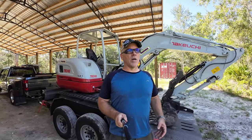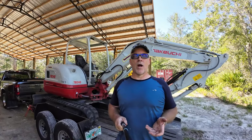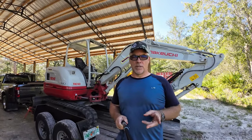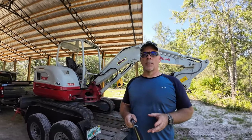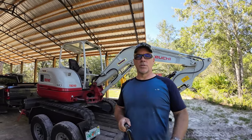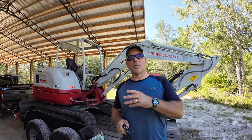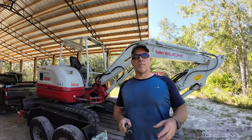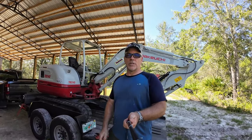But if you've watched any of my other videos in the past, the thing that I keep harping on is buy as much horsepower as you can afford and is practical. You got to have both of those things. You can never add horsepower or capabilities to your equipment, right? If it's 40 horse, it's 40 horse. You're never going to get 50 out of it. If you need 50 on occasion and you have a 50 horsepower machine or a 57 horsepower machine, that's great. You can always use less, but you can't add horsepower. So that is something to consider.